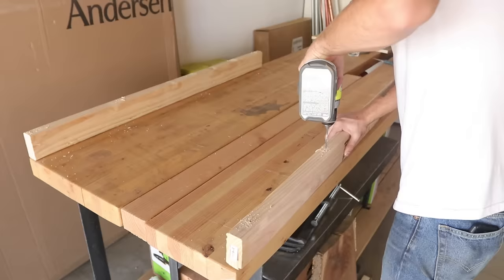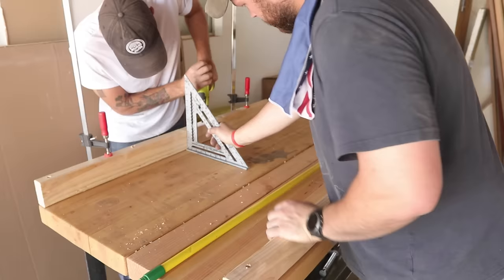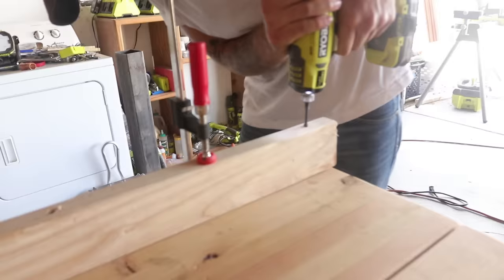What we're doing is pre-drilling the 2x4s and then countersinking them. We'll clamp them to the table and use some 3-plus inch deck screws in order to fasten them down. I'm using a triangle to keep everything nice and square, and Mike's burying them home with an impact driver.